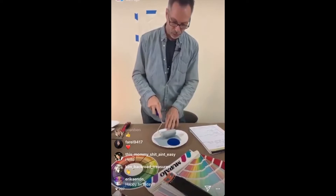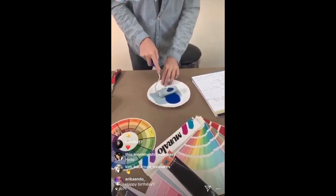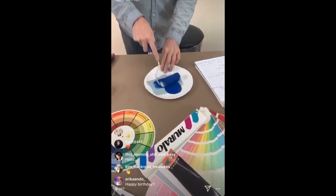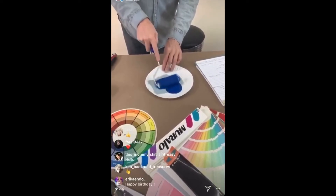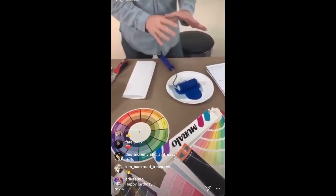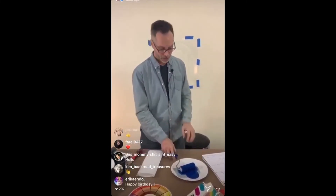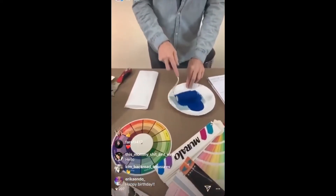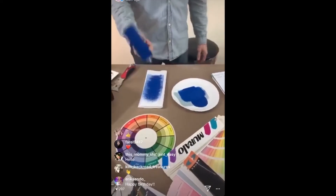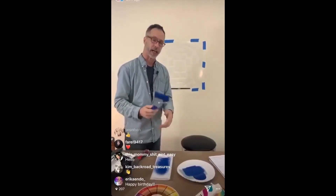While I'm talking, I'm going to load this roller. I clean my rollers nicely so I can reuse them — I love to recycle. I'm going to deliberately and evenly load my roller, because the biggest mistake in stenciling is overloading your roller or brush. When you have too much paint, it's inevitably going to seep underneath the edge of your stencil and give you bleed. So load it, then offload one or two rolls for a perfectly loaded dense foam roller. We sell these at Cutting Edge — don't use anything with a big nap; you want a nice tight nap foam roller.